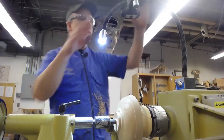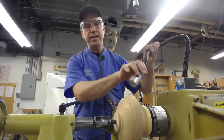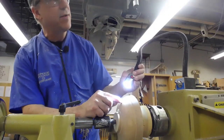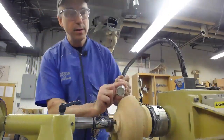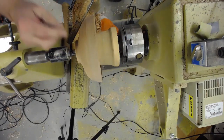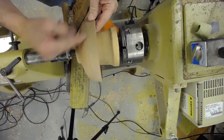So I've got a much better shape. You can see there's still some high spots and quite a bit less tear out. There's a little bit of tear out — it's always on the uphill side. Here's your end grain, here's your tear out. The next thing to do is some shear scraping.